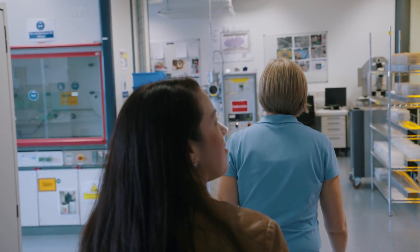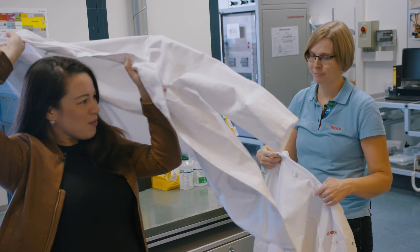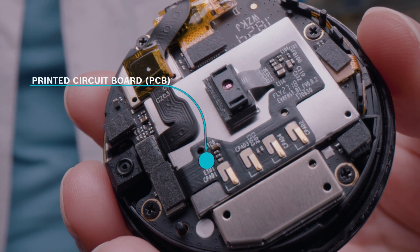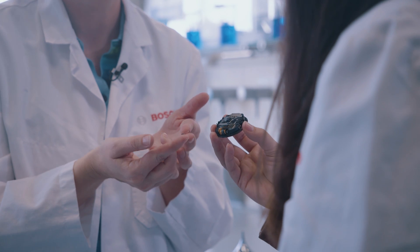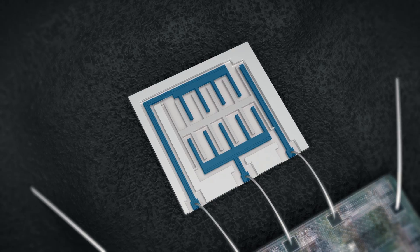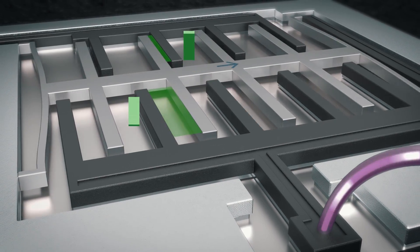Can you show me what it looks like? Can we actually see inside my smartwatch? Yeah, should we open it? Grab a coat and grab some safety glasses. So where exactly are we? So today we're in the training lab. You actually got it open — yeah, we got it open and now we can see all the semiconductors that are inside. Here we have one of the chips from the backside of this PCB. This is an inertial measurement unit. It has three gyroscope and three acceleration sensor axes — real moving parts in here on a microscopic level and an electronic circuit which interprets all of those signals.